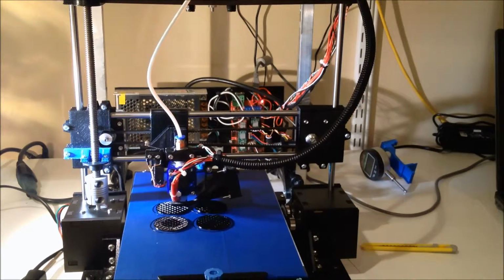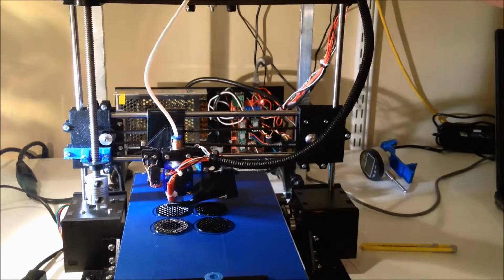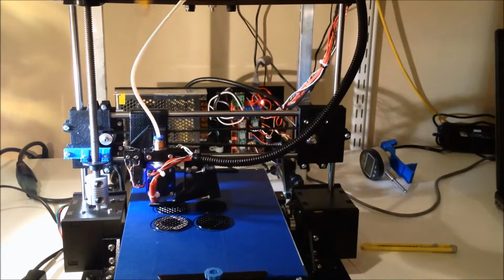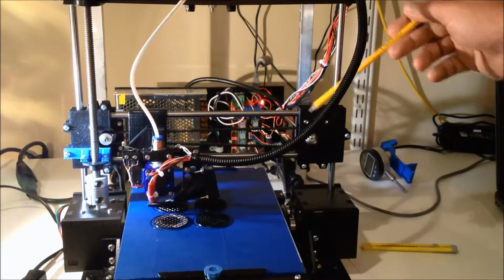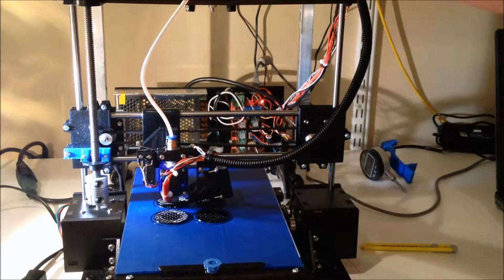The other thing that I did is I got this to pin the Z mount back to the gantry itself. This has worked really well, because when this freely rotates, the Z motion allows this gantry to skip. While it still skips a little bit, this has been a great improvement.